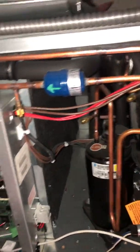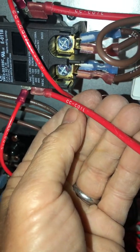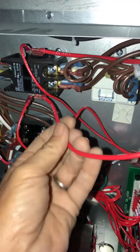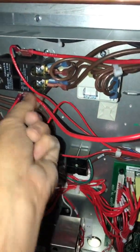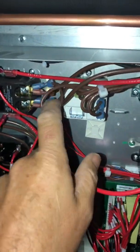The installer didn't have the grommet here, so I went through the other hole. Two sets of wires — see here — cooling coil or CC coil. That's low voltage right here. Move this wire over, put this one right here, that one right there. When you call for 24 volts, it sends 24 volts to the motor or to the P66 controller.